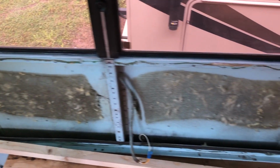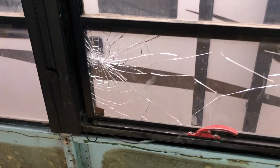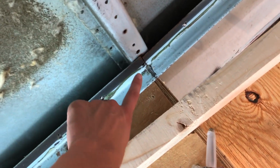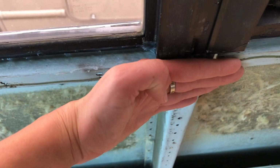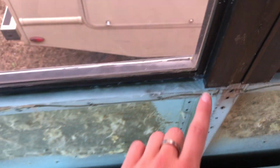So I'll show you what we're doing. Pretty much every section of the wall looks like this right now. We ripped out that old insulation. Right now, we're gonna be taking 2x2s like this, and framing out the wall here, at the floor, and here. It's gonna create an equal depth so that a wall can be placed right over that, and there will be a windowsill ledge here.